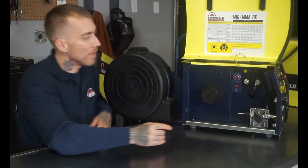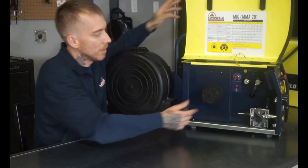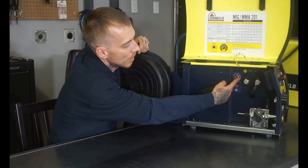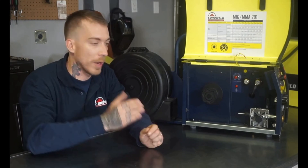It's very easy to do. You just open up the side of the machine, get in there — it's an easy-to-read gauge — make your adjustment and try it out. That allows you to control your burn back, giving you a quicker setup time between jobs, saving you from having to carry side cutters to trim after every weld, and preventing tips from burning up excessively when they're getting stuck because it's set too low.